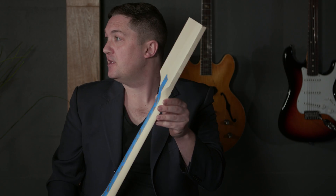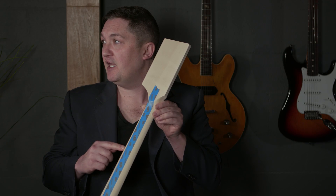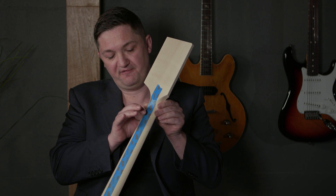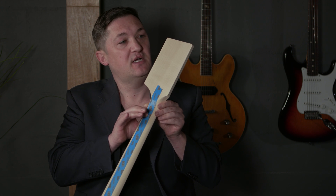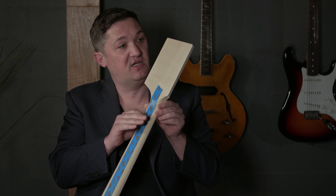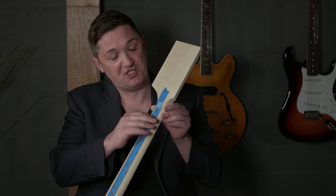What I've got with me is one of my own maple neck blanks. I'll show it to this camera here so you can see it. What I've done is put a piece of tape down the middle to divide the neck into three equal parts. When a luthier shapes the neck, they tend to think of it in these three parts — this is the front-to-back depth, how thick the neck is. A lot of Strats' necks, especially modern necks, are about 22.5mm thick at the first fret, and they'll go to about 23 or 23.5mm thick at the 12th fret. But the thickness doesn't affect the feel in the hand as much as the shape — the contour of the back of the neck.